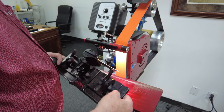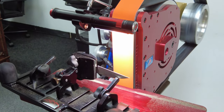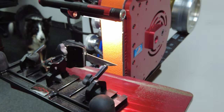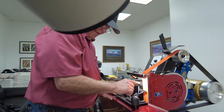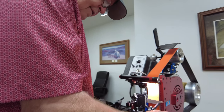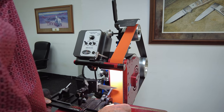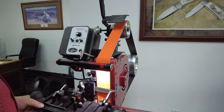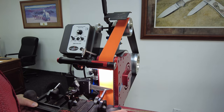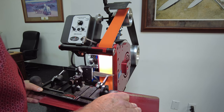I'm going to leave this now and go to a 220 and show you how to put the plunge in. You can do it with a 400 or 220. Notice I'm putting pressure on this side of the belt — I want to cut the edge. This is going to cut much quicker, so don't go straight through every time. It's thinner and it's going to cut quicker. Back here where it's thicker is where you need to be working.